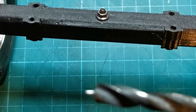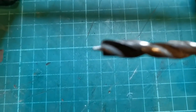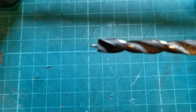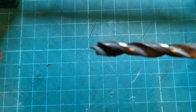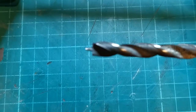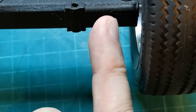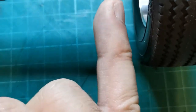This is the drill I was referring to — it's a 7mm wood drill with a flat edge and a tip. When you run that in the hole it cleans the hole and makes a very small dimple in the end. You could run a 7mm drill all the way through, but there is a stop inside the plastic part for the insert to stop against.